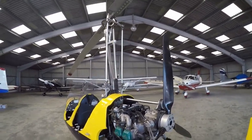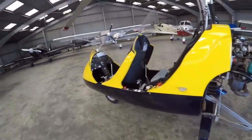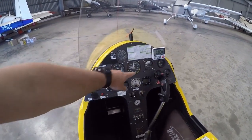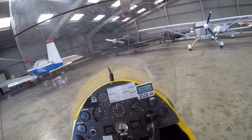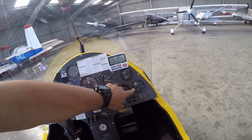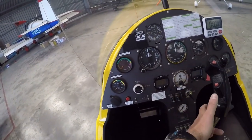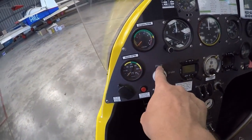You can also see the takeoff for the pre-rotator off the prop. As you come round to the cockpit, you'll see that the basic layout is pretty familiar, certainly if you're an MTO Sport pilot. This aircraft has an optional vertical speed indicator. On the right-hand side you've got oil pressure, oil temperature, and cylinder head temperature or water temperature. Then there's a card compass, engine RPM, and rotor RPM. Just down here is the rotor brake flight switch, marked 'brake' or 'flight'.